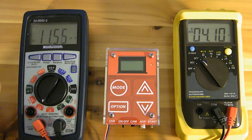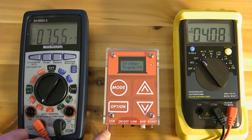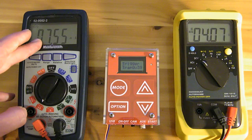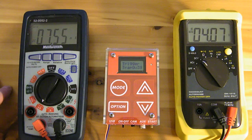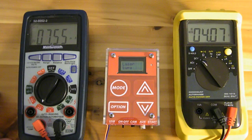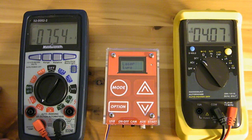Powering up — on the left side here, by interrupting the battery, we can see a current measurement. It's drawing 7.5 milliamps in normal mode when it's on. On the left side we can see the battery voltage, the power source being three AA batteries with a nominal capacity of about 2,500 milliamp hours.